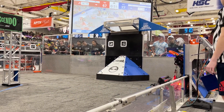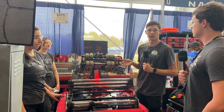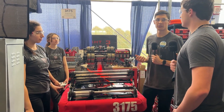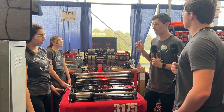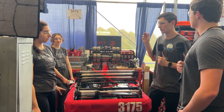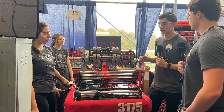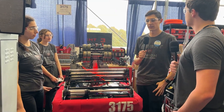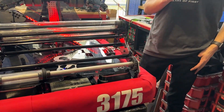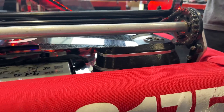The goal of this bot was to be incredibly simple and effective. We prioritize subwoofer shooting so that we can make as many shots as possible — we just want to be super consistent. We also wanted to be very durable, so our intake and shooter have gone through many revisions. We prioritize very fast cycling, and we customized our Mark 4i modules to reach 23.25 feet per second instead of the standard 19 or so.